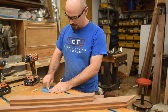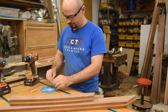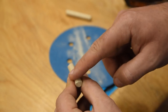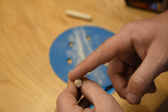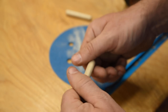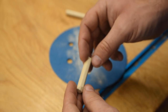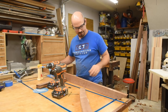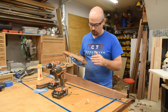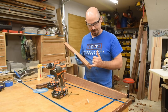I'm going to scuff the dowels a little bit to help give the glue some room to move as well as something to bite to. Chamfer the ends just a little bit — you can chuck this up in the drill to chamfer it easier. I'm going to do some little wedge flats on each side. The idea is to give the air, not just the glue, some way to get out and a way to help the glue spread. I can twist this a little bit and that'll help carry the glue around to make sure I don't rub all the glue off while I push it in. There's a lot of end grain on this glue-up — end grain isn't really going to glue, so I'm not going to bother trying to get any glue on that joint. All the glue is going to be in the dowel.